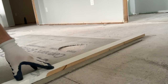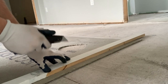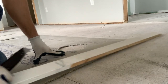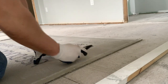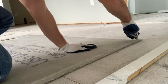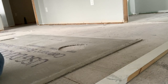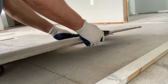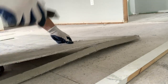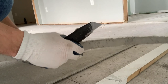To do a straight cut on this stuff, it's really similar to drywall. I put my mark, I got a straight edge here, put a mark down on this end, then just take your utility knife. Then set that to the side — you have a nice little scored line. Put a good bit of pressure on it, score a few more times, then just like we did the other piece, bend it and run your utility knife down the edge. This quarter inch is way easier to cut than half inch — same process on the half inch is just harder.